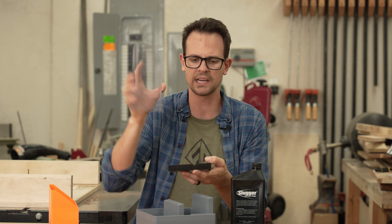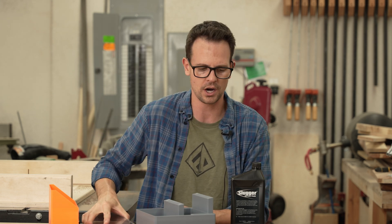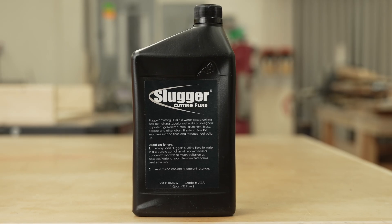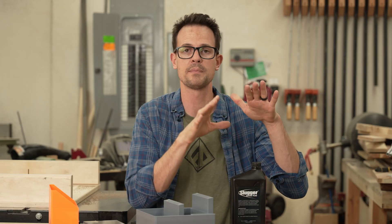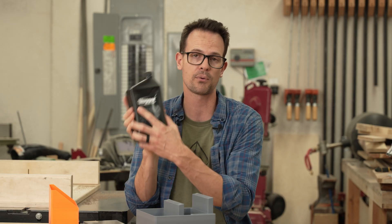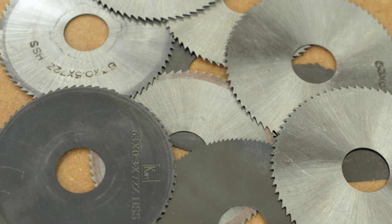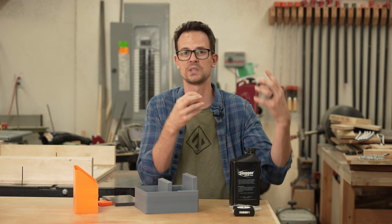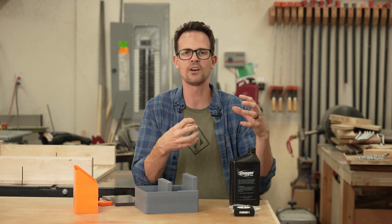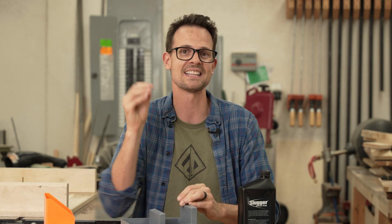Before I had these tiny little parts for the top to keep the rings in. I'm actually going to make one out of acrylic because I have some scrap acrylic, just so I can see what's going on. For the coolant, I bought some Slugger cutting fluid — you mix it about 10 to 1 with water and that should help me not get rust and also has better cooling properties being a proper cutting fluid. For the blades, I spent way too much money and bought a whole bunch of different types — different thicknesses, plain steel and tungsten carbide, and then also different tooth numbers — so hopefully I can get a feel for what really works best for cutting steel chainmail jump rings.